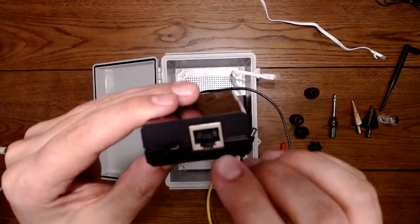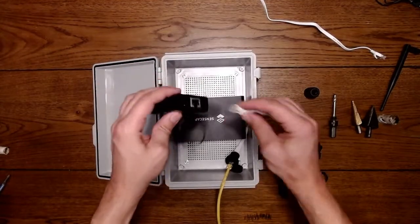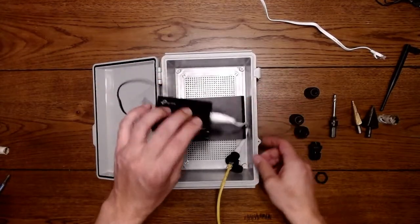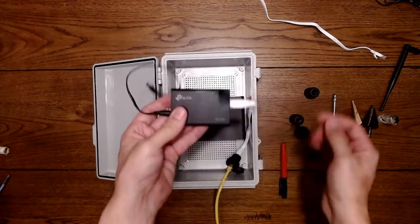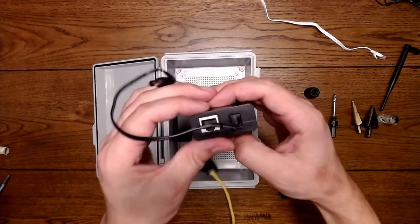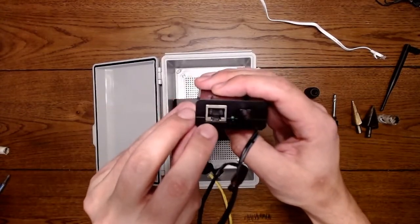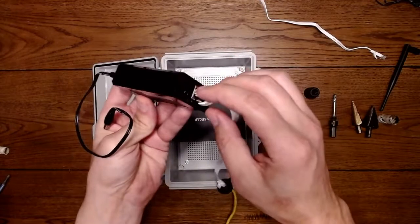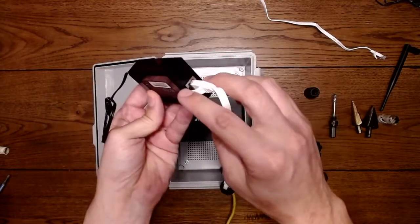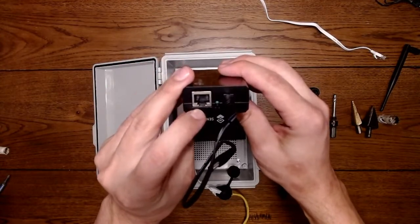And this is power, data, in. So that's where this is coming from. We're getting power and data from the modem or router that we're using. And so now this is powering and sending data. On this side, it's only putting out data. It's not putting out power. So you get power and data here. Decide what voltages you want, and then you're only getting data on this side.